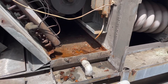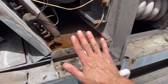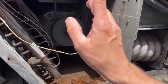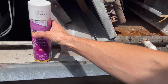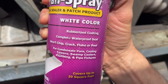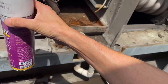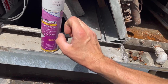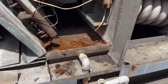So my next option is: can we seal it with something? What I would recommend at this point, just for temporary use, just to stop it from leaking downstairs — vacuum this out, shut off my cooling, allow the fan to run only to dry this up. Then vacuum it out, scrape it up gently and wire brush it. From Nu-Calgon, I've used this product before — pan spray. It's a rubberized undercoat, a complete waterproof seal. They make it in black and in white. I called the manufacturer because it does not say on the can how long it takes to cure. They said 30 minutes before it's tacky, but they'd give it an hour before it can take water droplets from condensation.